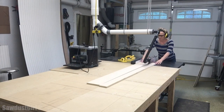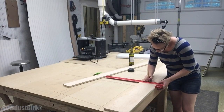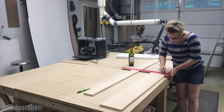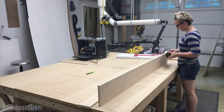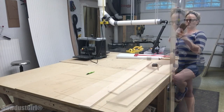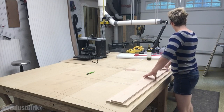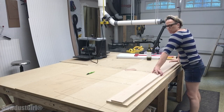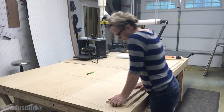I started out by finding a piece of plywood in my scrap pile and cut it to width. Then I marked the center line and the location for each of the bottleneck holes that I wanted to drill. Then I used an empty wine bottle to play around with the angle, and once I found an angle I liked, I traced the neckline onto the wood so I could follow that angle as I drilled my holes. Then I used another piece of scrap plywood — the piece I had cut off earlier — and glued it onto the back of the piece I had just marked.